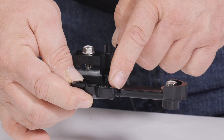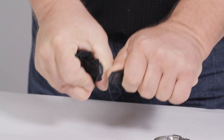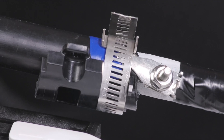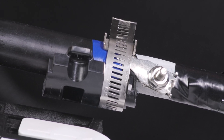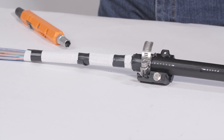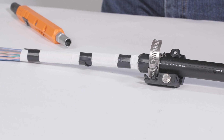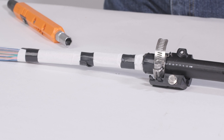The sheath will protect the fiber from the rough edge that remains. For wrapping tube cable, break the cable attachment unit at the cut line and discard CSM retention. Since there are no strength members in wrapping tube cable, the sheath may be cut at the cable attachment unit or it can be run to the basket. You may also run the water block tape to the basket by leaving 10 inches of water block tape beyond the sheath cut for added protection. Fiber and water block tape will be secured at the basket yoke.